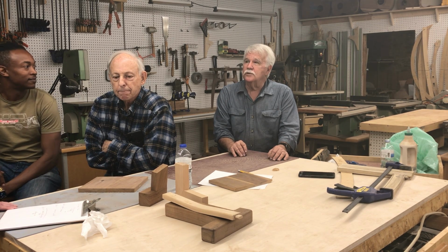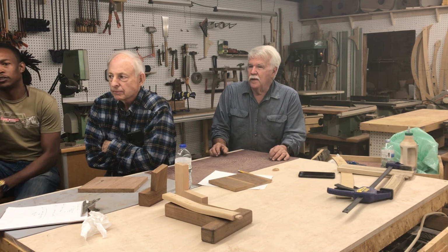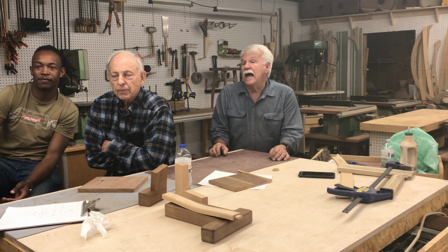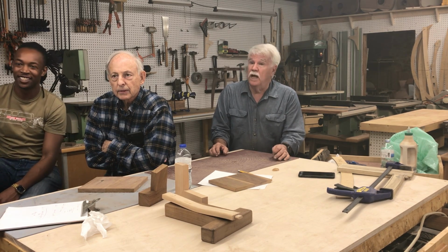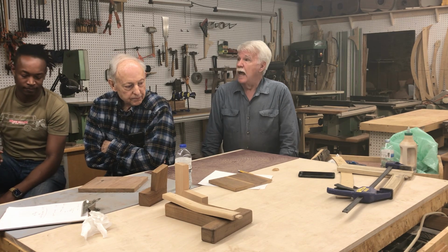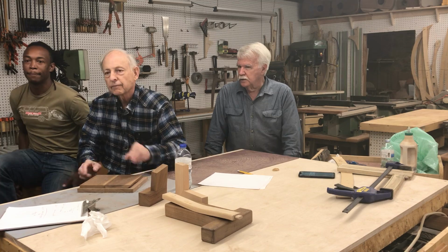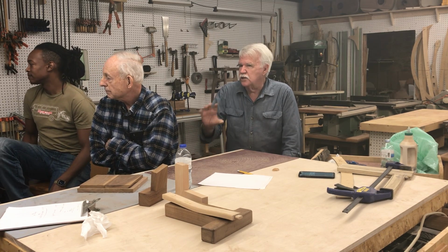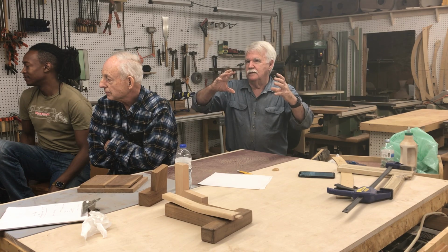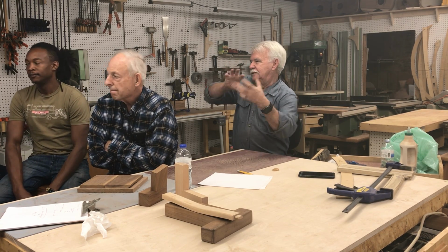And the prototype 48-inch coffee table, yep, I made with dowels, because I made it a long time ago and didn't have the Domino machine. The dowels worked, but the registration was off a little bit. I was able to compensate as I sculpted it in. But the problem with the dowels is the legs. You had to really be careful, because they would twist like this.